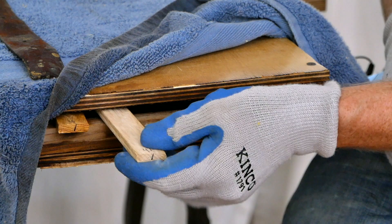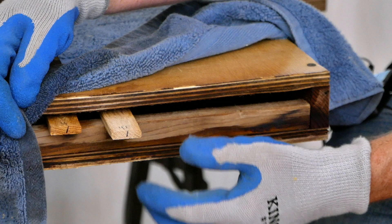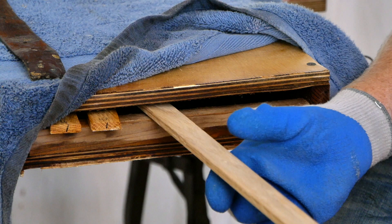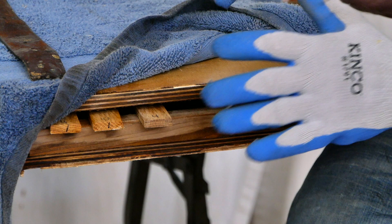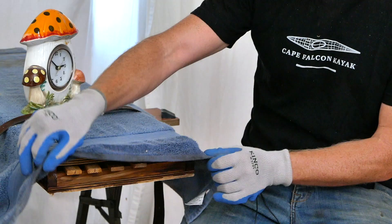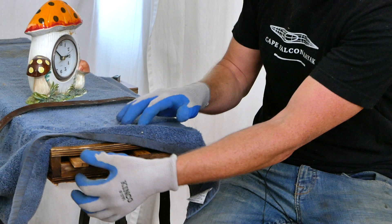We're going to wait a minute and then put in the next one. I'm going to put another piece of Oregon white oak in. Anytime you're loading a steam box you want to be careful you don't accidentally push the adjacent rib into the box where you can't get to it — it's a good idea to leave a little bit of the end sticking out. Now I'm going to put in a piece of southern white oak. The reason I'm doing these sequentially in one-minute intervals is it's going to take me about a minute to do each of the bends, so that keeps me right on top of my four-minute steaming time.